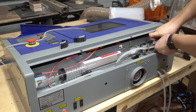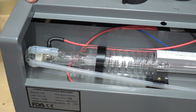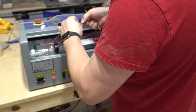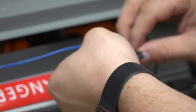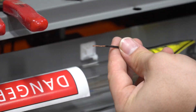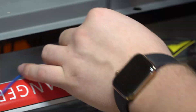It's pretty simple — just go the reverse of what you did. Put your water cables back where they were on the last tube. It could take a little bit of fighting to get it on, but it eventually does slide on. Then I started to work on the wiring. I took the ceramic break off — that's to help with heat dissipation. These wires are just twist-tied together, so I just re-twisted them together. I put that back on and reused the same silicone or electrical tape they used, then went back and zip-tied it so it wouldn't move. Up here, once I undid it to reattach it to the new cable, I felt it would be safer to use a crimp connector. You don't have to do that if you don't have the tools, but I decided that was the best route. I then zip-tied it back to the hold-down. That is very handy to have. I clipped the excess, and now it was time to start getting the tube reattached.